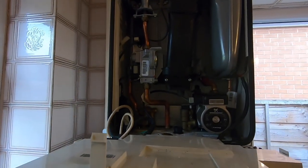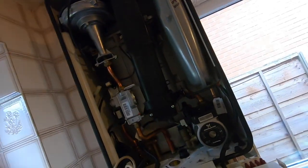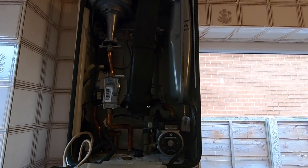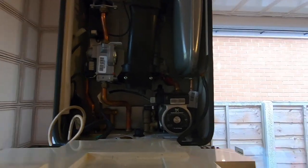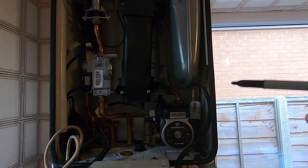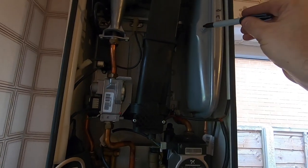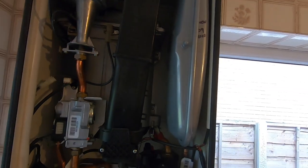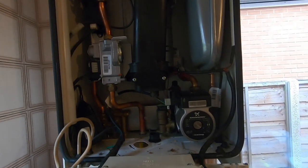Alright then. So what I'll do now is get the pressure back up and that should sort it. I might just have a quick look at the PRV actually — I want to make sure there's no dirt on it. Expansion vessel season. So if you ever get any sort of passing or dripping out of the wall, the first thing you need to look at is the expansion vessel. Pump it up — if it'll pump up, always check the Schrader. In this case, the Schrader split. It should be good to go now — it depends on your system quality, but the PRV should hold. Pretty good on these boilers.